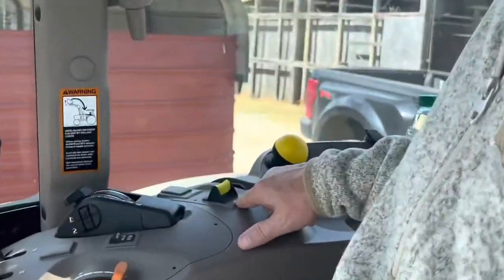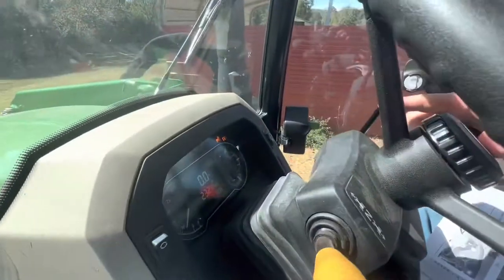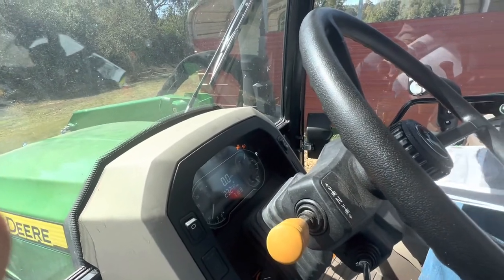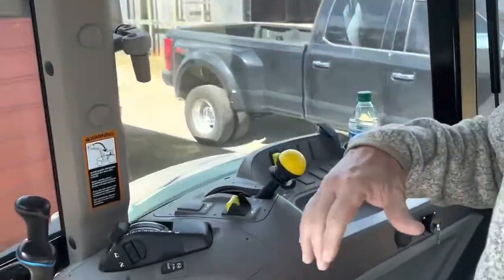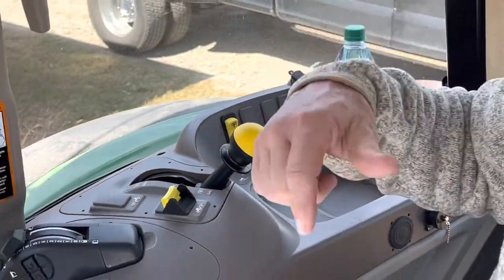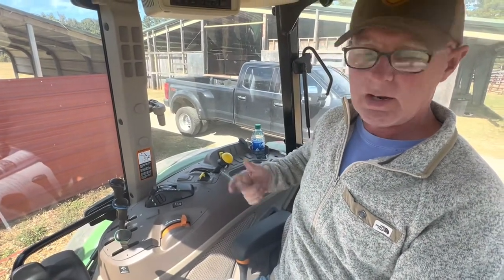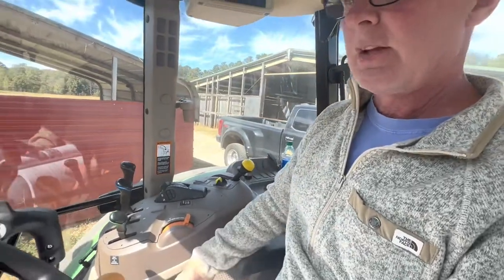So to turn the PTO on — like to run the bush hog or something — you push this down and turn it on. You'll see the lights on the panel come on to tell you the rear PTO is running. If you get up out of your seat, it'll start beeping and the PTO stops operating. But if you need to leave it running to go check something, you can enable the remote PTO — the light comes on and you can get up and it continues to run. When you sit back down, that light will turn off, so every time you go out to check you have to hit the switch again.